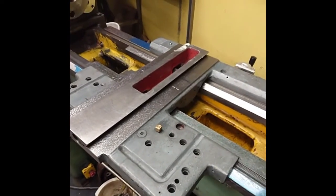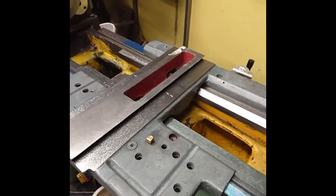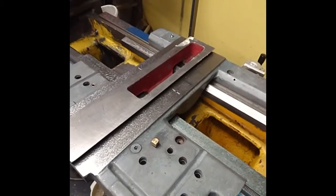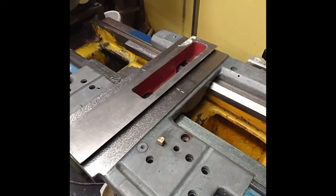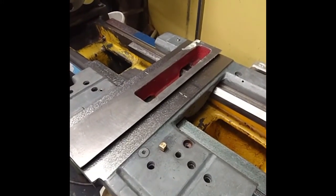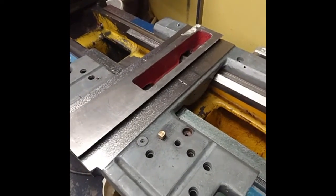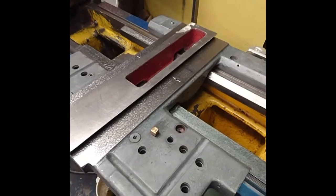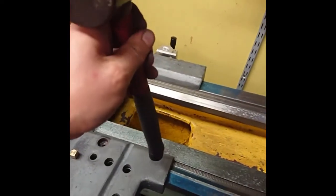Finished all the oil grooves and channels and boring and drilling and milling and this and that, which maybe would have been a nice idea to start with from the first, but anyway, now everything is in place and I just put it back on for a final check of alignment and fit. I'm just going to do the tap test here first before taking it off.